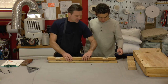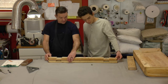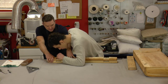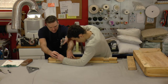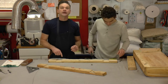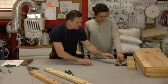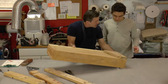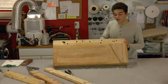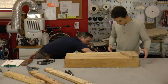I don't like splitting and turning it around, but I've got no choice - I want it to be identical. Now it's even, so that's good. Let's do the same thing for the other one - mark center as best as you can, hit it. That gives us a pilot hole for the drill bit so it doesn't crawl and we know where center is. Now this piece has all those holes the previous person put in - a lot of dowels, a bit of overkill. That's veneer - it's not going to hold. We're looking for 9/16 staples.